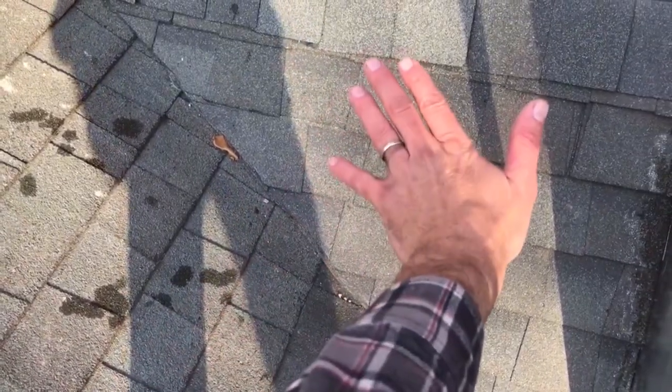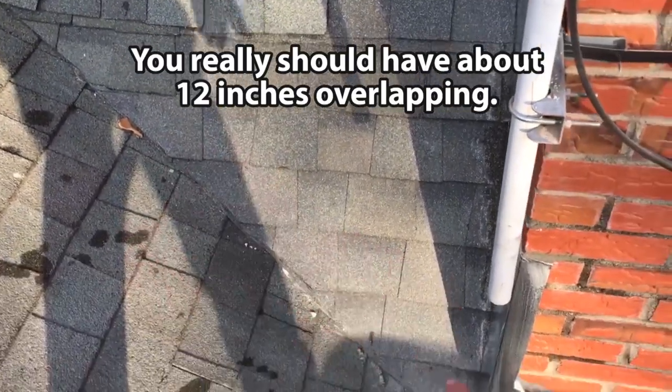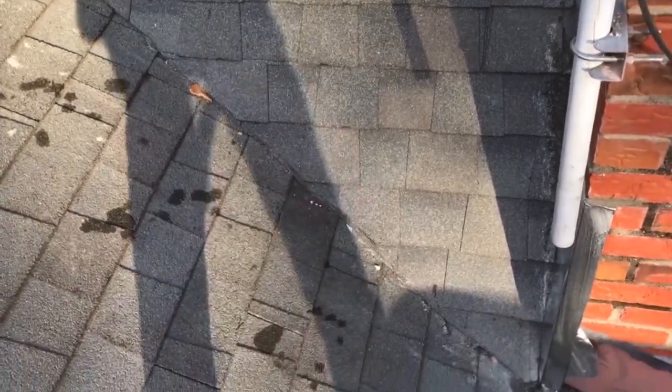But as you saw when we roofed it, this roof goes way up under there, so that anything coming down there, there's two roofs basically, for at least 6 inches under there, protecting it all. So nothing should leak in that valley.